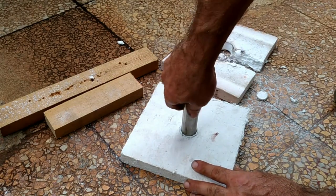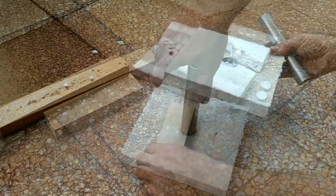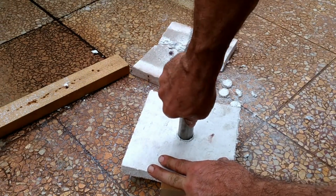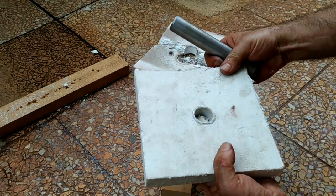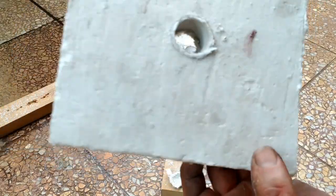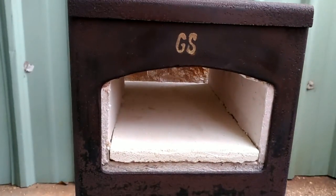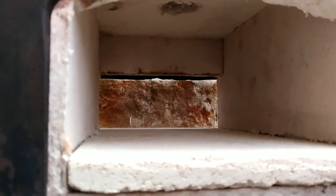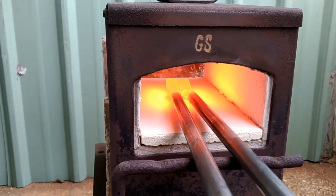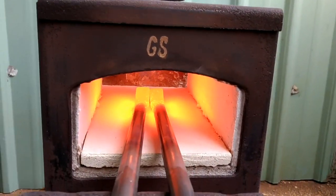I sharpened a piece of pipe on one end and use that to slowly cut open a hole in the ceiling. I've done this in the past in different ways but found this method of using the pipe to be most effective on this fibrous refractory board. The ceiling opening needs to be pretty accurate for the forge to run properly. This time I just replaced the ceiling and the floor, which was really in bad shape, and the sides I just reversed — that's why they look newer. The new lining really makes a big difference; it's just working way more efficiently.